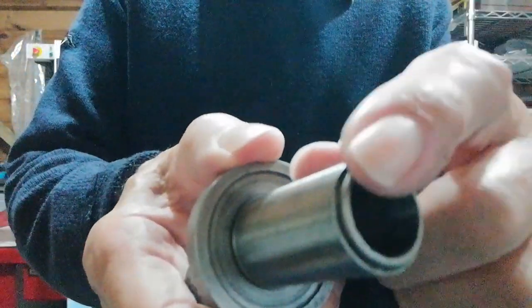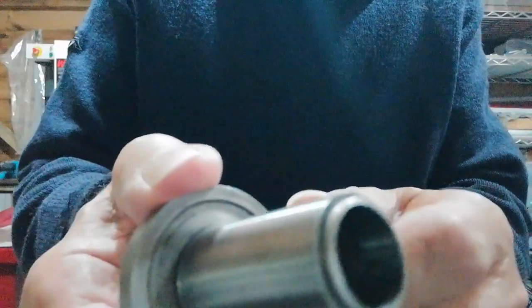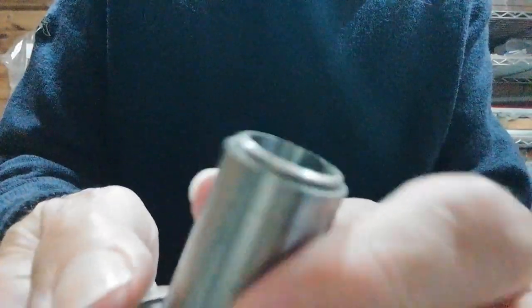The reason I suggest aluminium is because the collet fits into there and you must remove the collet first before you attempt that method, because we don't want to damage that surface. So no steel piece that is harder than that — you could use a copper-faced bar, but an aluminium piece is much easier to use and doesn't damage that surface. But you take the collet out first.